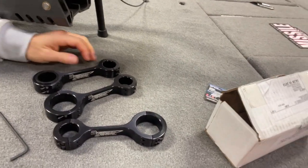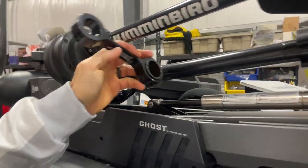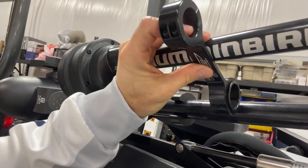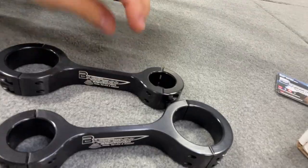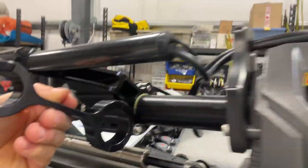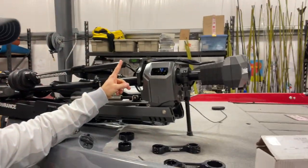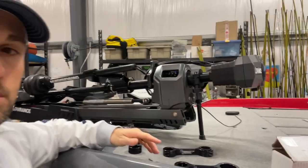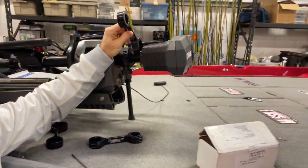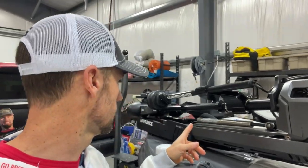You get these three rings with the Bass Fishing Electronics mount. One ring goes down on the lower portion of the shaft that spins — right here on the part near the little coupler — and that's going to hold the Humminbird 360 firm up there. Then you've got two more with a bigger hole: one goes around the upper shaft and one goes here. If you have the UltrEX or the universal mount, you can still use this because they give you a second ring you can put up top to hold the shaft really still so it won't go anywhere. Really cool.